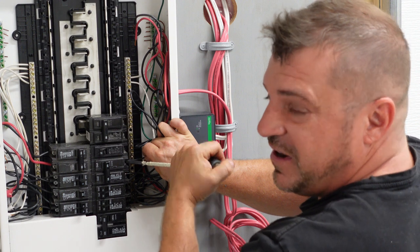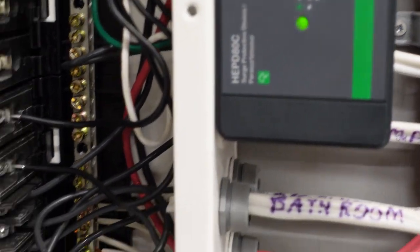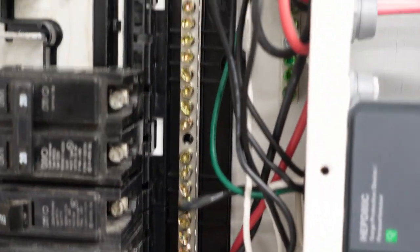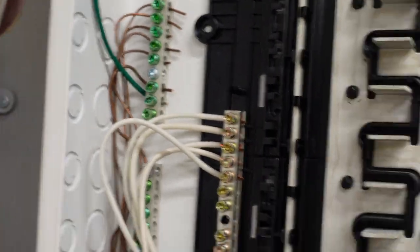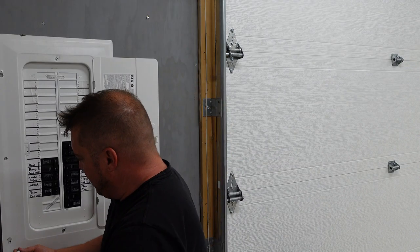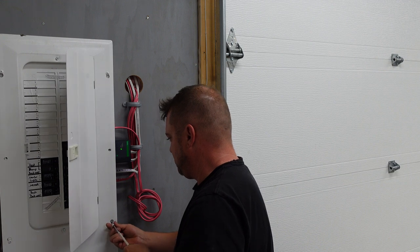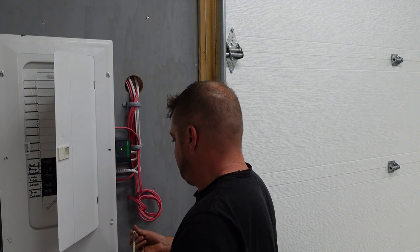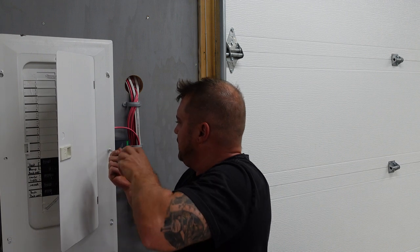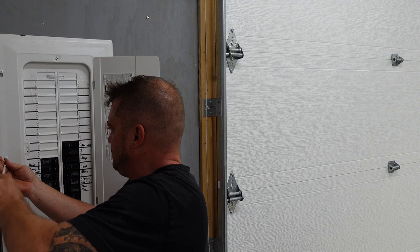By the way, the cost on these is around $250, but worth every penny. The green light has come on indicating that it's working, and we have it tied underneath our double-pole 20 amp breaker. Our neutral is going up to our neutral spot and our ground is going over to our ground. We'll go ahead and put our cover back on. And there you have it — it's as simple as screwing our cover back into place with our new spot for our double 20. I'm going to have to relabel it as surge protector. It's that easy, folks. Surge protectors are a great way to protect your home for years to come. Don't forget to like and subscribe, and we'll see you guys next time.